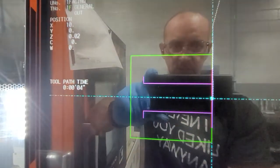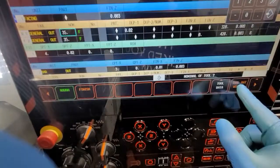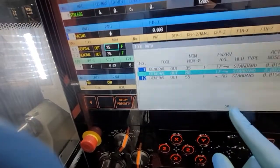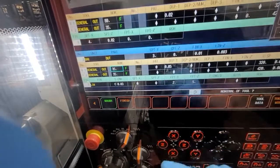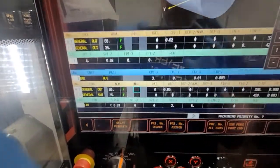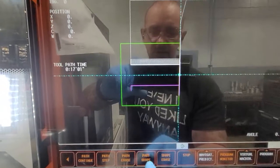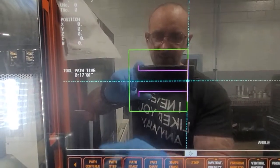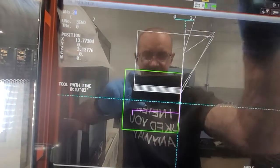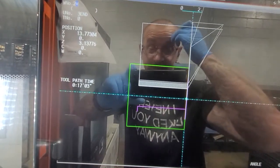So we go path continue. What we're going to do is exchange the tooling — we'll use an 80-degree tool for the rougher, because she's going to behave differently. Now she has to go back, change the tool, come back, and it's going to be different versus if she's using just one tool and doesn't have to leave anywhere. So this is all path — let's do path erase. Now you see what the 80-degree tool does — she acts a little different. Even though we have that TPC for the facing, we don't have that TPC for the OD turning, so she comes under an angle.